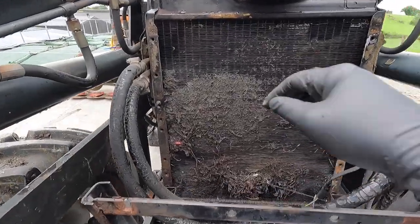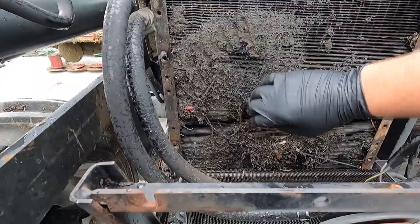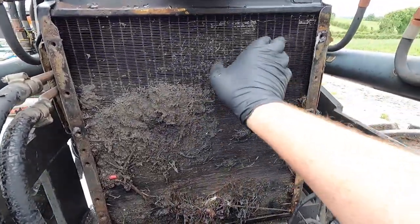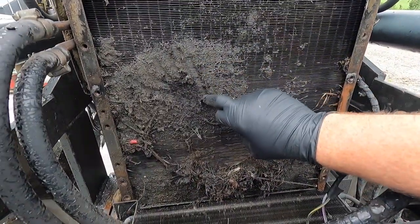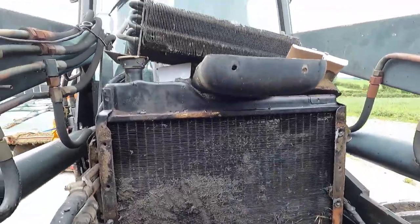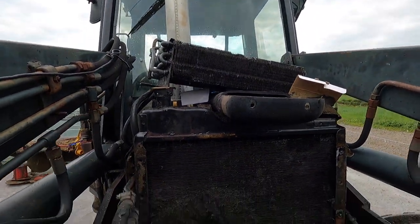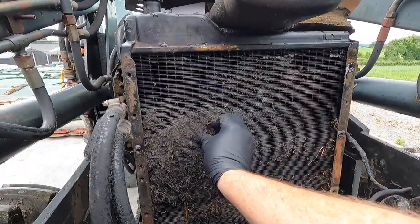We're eventually in at the water radiator. Clogged. Look at that. Completely stuffed. Well, it's stuffed down below. There is room up here, but still, look at it. It's just greasy stuff. I'm not sure where that's all coming from, whether there's a leak in the actual oil cooler radiator. I'm not sure. It's oil that has stuck the stuff to it.